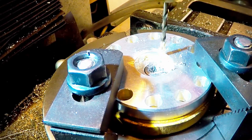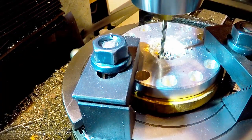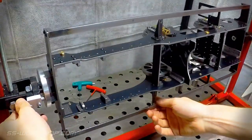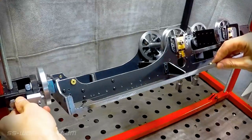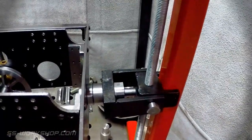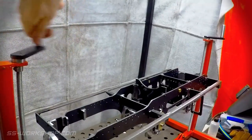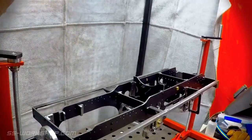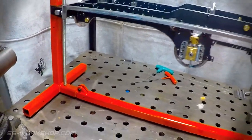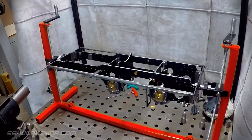I then drill a couple of holes to allow for mounting — these match threaded holes in the shaft it fits to. Once that was done I could finally assemble all the parts. You can see it together with the rotation; I made up a small spring-loaded pin as my locking device. On the other end I have a sliding pin detail which will allow for a change in length when one end is raised or lowered. Between the two stands I made a linking bar with clamps at the end which clamped to the smaller diameter square tube. With the build stand complete I think it's going to help a lot with the build going forward, allowing access to all sides.